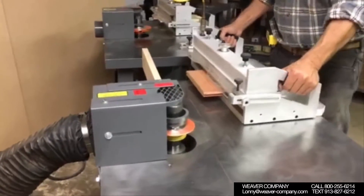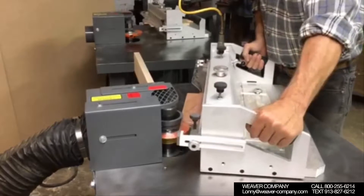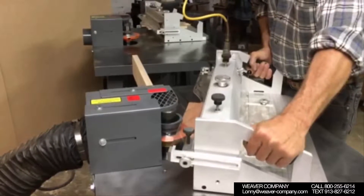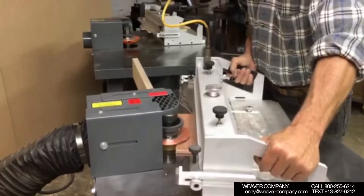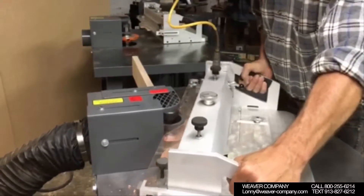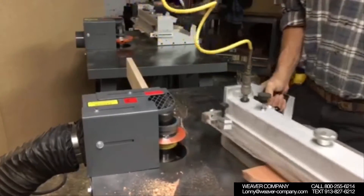Now we're going to run our template against a dead collar, and square edge cutters are going to shape the top rail out to shape in the ShaperMaster. In this particular application, with good cutters and good wood and handling to the right, we didn't even have to bandsaw this all out.